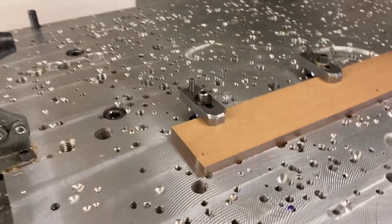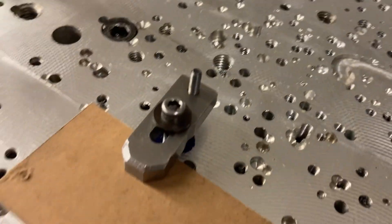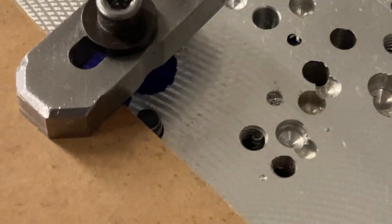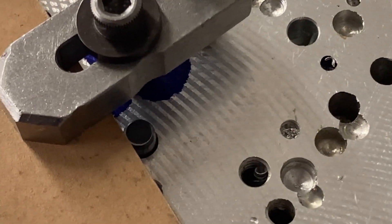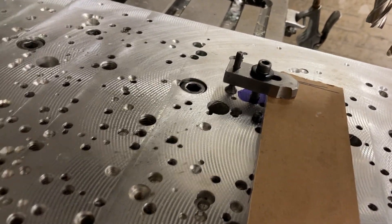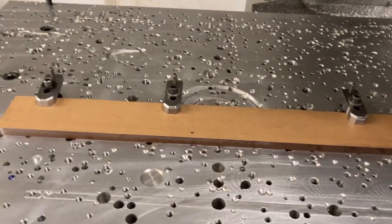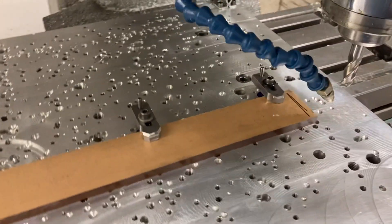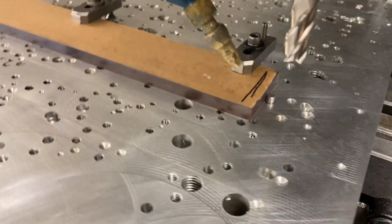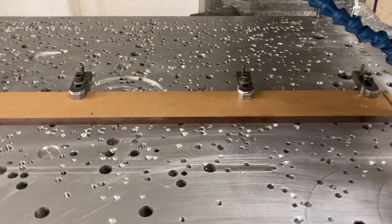What I did was get my little clamps holding it down, pinching it in place. But to line it up, I put dowels in - see that dowel right there? Dowel pin there, and one down the other end way down there. That creates my straight line that I can bank the part up against, so I don't have to indicate it. If I was only doing one I'd just indicate it, put a clamp on it. But I've got more than one to do. On this end I have a dowel too, so I bank up against the back and slide up against the stop, then clamp them down.